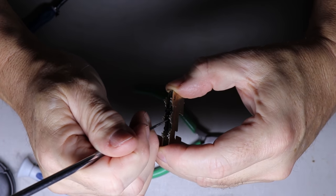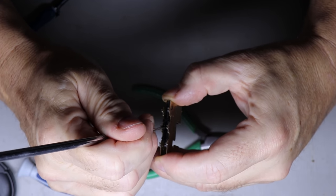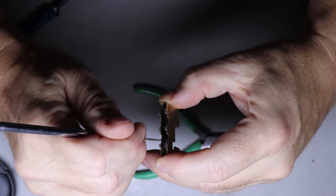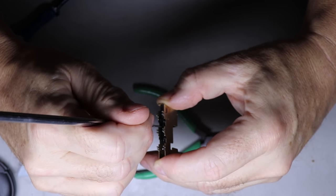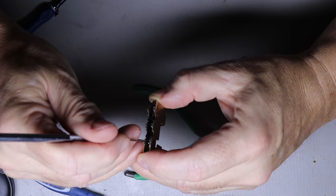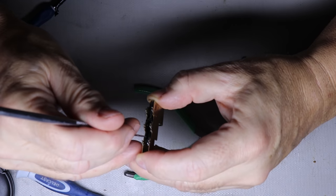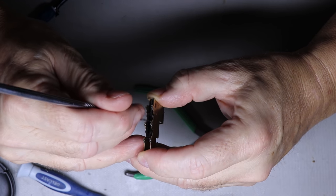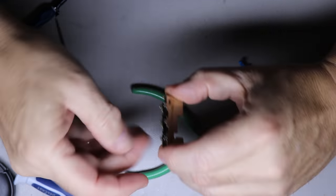These are all gummed up. This will not spring back like it should. As I move this, it's freeing up some, but that's the problem. Yeah, it's better. But that's got to be cleaned out. It's a lot, like I said, like tape decks. This old grease just starts to harden up, and it gets more like glue than a lubricant over time. See, it stuck that time for me right down there. Won't quite pop back. And that's all this old grease in here.